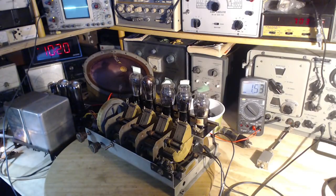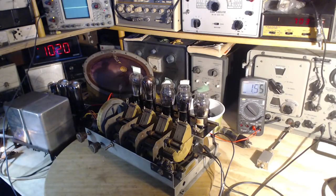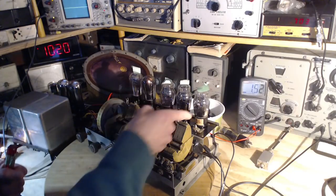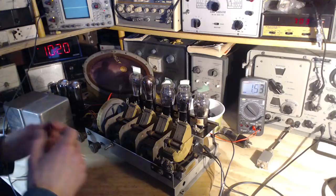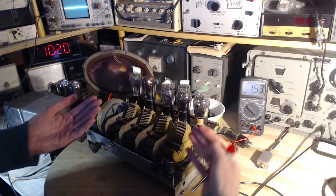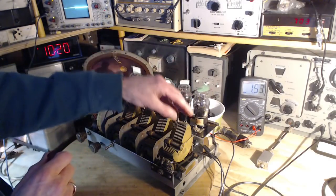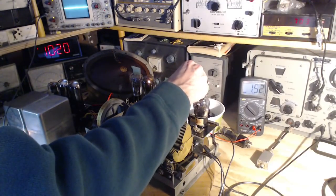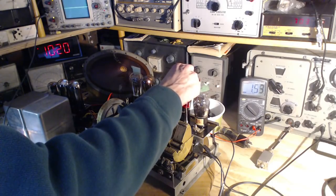Okay, now, against all the rules of radio repair, I just can't hesitate. We've got 3 controls here that affect something called balance, and we got 3 controls that affect the actual alignment of the tuning through here. I want to adjust the tuning, try to maximize that thing. Yes, I'm using a metal tool. Watch it now.